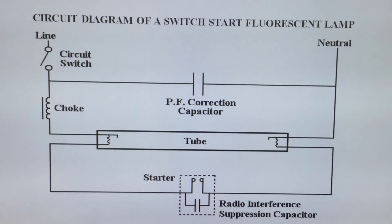The circuit diagram shows the basic layout for a fluorescent lighting circuit. When the switch at the door is closed the circuit is made through the choke, through the end of the electrode on the tube, through the starter. The starter blades are in the open position, so the conductive path is through the gas within the starter, typically neon. When that gets warm the blades close in the starter, completing the circuit down the other electrode and back through the neutral.